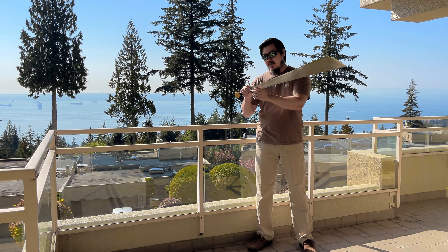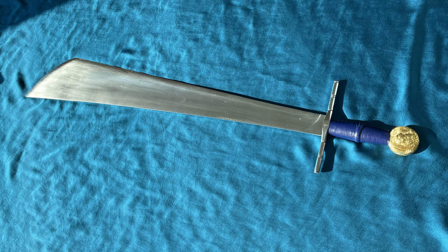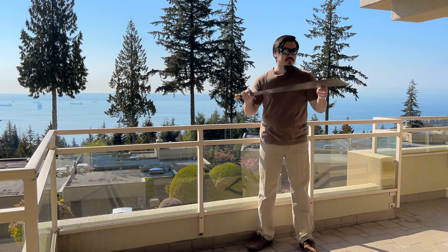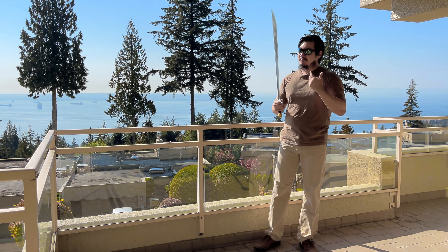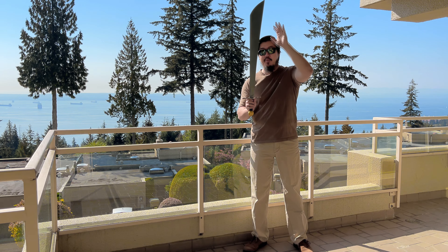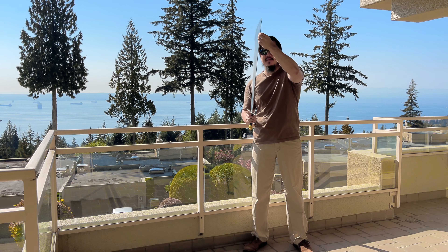But as I travel along the blade, there's a pretty evident concave fuller geometry on the blade. I don't think that's really needed for the lower portion of the blade. On the upper portion, that's sorely needed — especially if you don't have a spine that's thin.